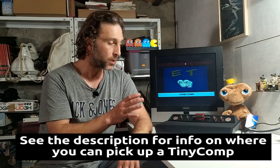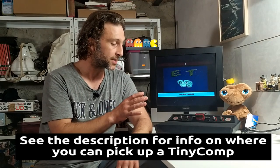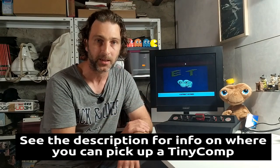today, because a month or two ago I was contacted by a guy called Rudy from a YouTube channel called Rudy's Retro Intel. And he let me know that he had built a little kit. He has a little kit available that will build a little module that he calls the TinyComp. And what this TinyComp will do is sit inside of an old retro computer or retro games console, and allow you to tap into the RF modulator or the RF can inside that system, and you'll get a nice composite image that you can bring out to a modern day television.